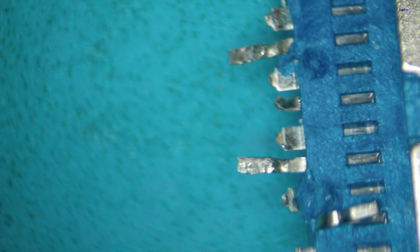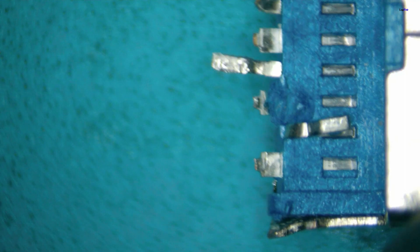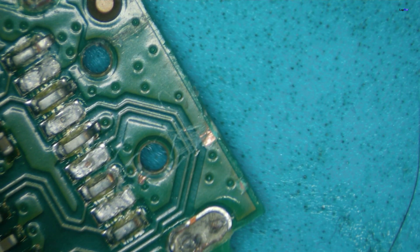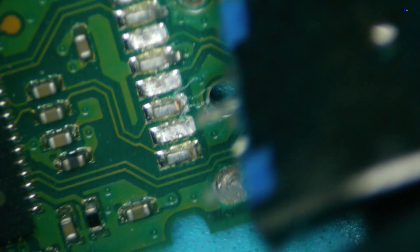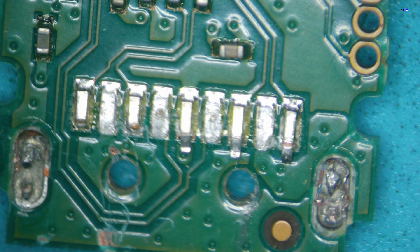Here's the main USB under the microscope — looks pretty healthy. The head has been guillotined, and there are the connections that go to the main part of the USB. We don't care too much about reusing this connector. The two anchor points at the top and bottom are just anchors to hold the USB so it's not being pulled on its traces alone — they're soldered with little metal hooks on the side. We want to replicate these trace lines; some are ground, some are data lines, so they're really important.